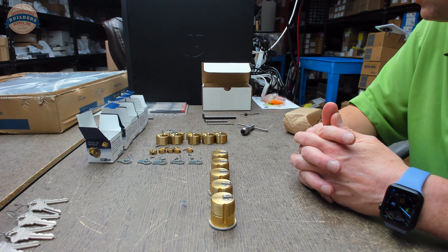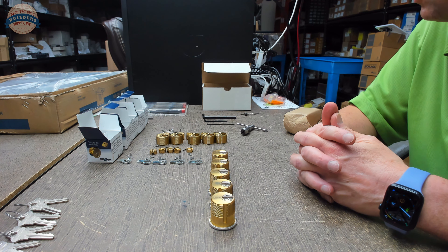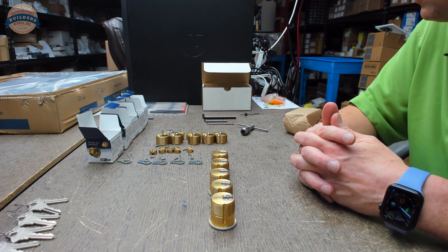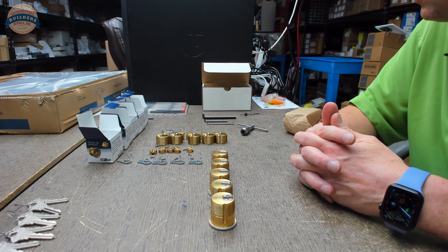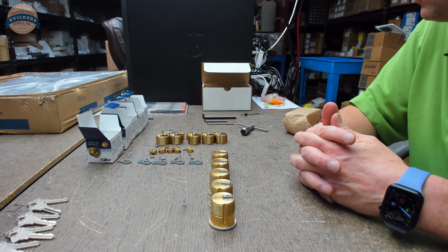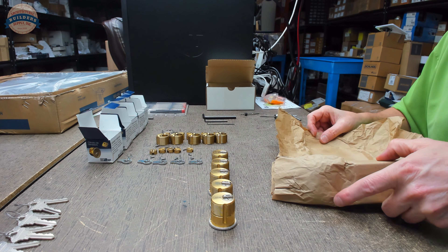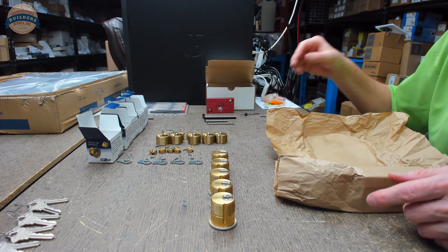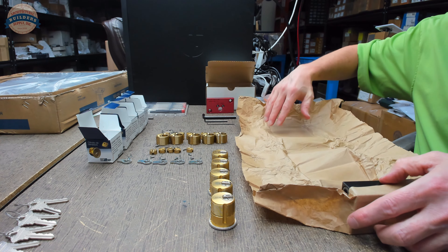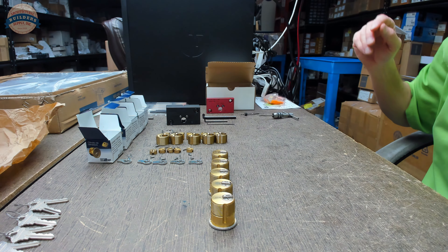The VMAX was a non-handed, square-edged door with a flush top cap and an inverted bottom channel. The inverted bottom channel is nice because if you've got a flooring problem — say the door hits the concrete at 75 degrees — you can take the door off, put it on a bench, and grind the bottom to solve the problem. Because it's an inverted bottom channel, you can do that.